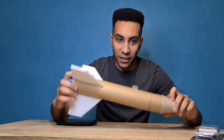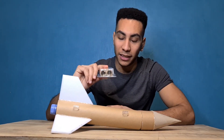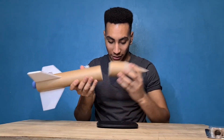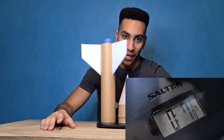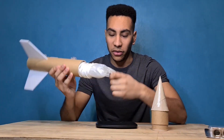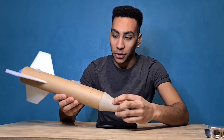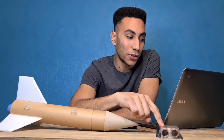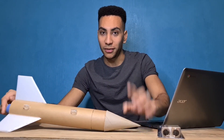I'm going to pause it there because this feels like it's getting quite heavy. So I had a quick look on the internet — turns out these are second stage motors anyway, and the maximum takeoff weight for these is four ounces. I'm going to weigh this and hopefully it's less than that, but it doesn't feel like it. Seven ounces. So we've got two options: we can either make it lighter — I've used very thick rope on the parachute so I can swap that — but that's not going to be enough. So the other option is to get a more powerful motor. The next size up is a D motor, so I've just ordered two D12-5 motors. They have a maximum takeoff weight of ten ounces, so we should be good to go.